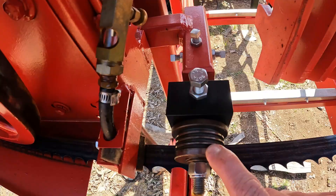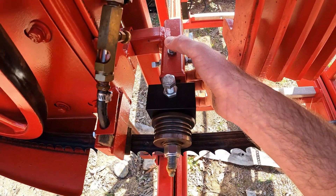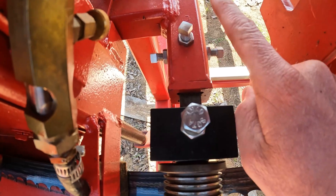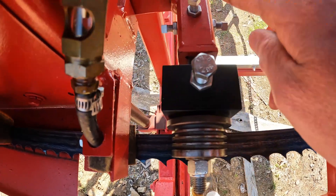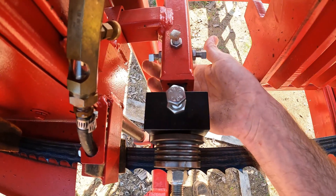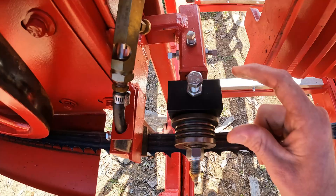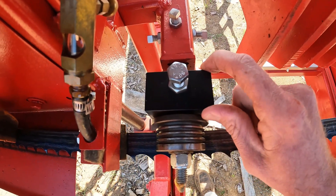To make that adjustment on these guides, we've got four square head bolts on the back. These are pivot bolts top and bottom to set our alignment, which we do have in another video as far as tilt using our blade alignment tool. In this case, I'd loosen the top and the bottom just to free that up. Then this block — it's on a key back here — and I've got some movement where I can slide it back into this tubing or farther out. So if I needed to push that guide back because the blade's hitting the back flange, I loosen the two bolts, push the block back in, retighten them. As long as I don't mess with the opposite bolts, the side and the bottom, I should not have to worry about realignment. If I'm doing precision cutting, that alignment is key — I'm always checking it after the fact either way. That is my adjustment for that guide, moving it in and out. It'll slide in and out of this tubing and I've got a good bit of variance for how far I want to move it, if I'm changing blade sizes.